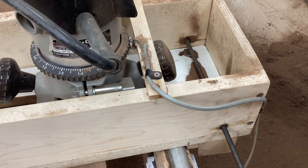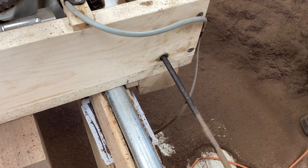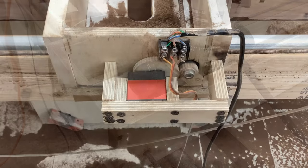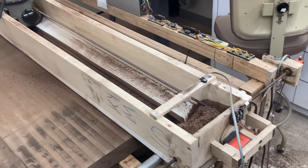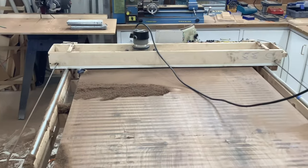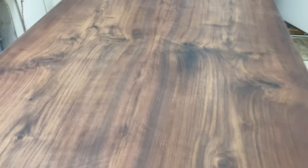There were problems when I tried to use the automated sled. The first was the movements were way slower than I expected — only about three inches per minute. This was barely tolerable for moving the sled, but the router movement was so slow the bit burnt the wood because of friction heat, and it also shortened the life of the bit. I used a pair of gears to step up the speed by two and a half, and I also programmed the router to cut in both up and down directions. This made it barely fast enough to flatten the tabletop, but it still took over 20 hours. The bit still left burn marks that required extra sanding. I removed the router sled from the work table and went on to make countless mistakes while finishing the table to my satisfaction.